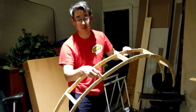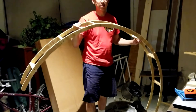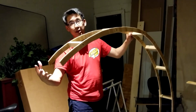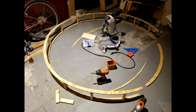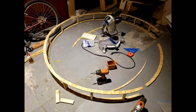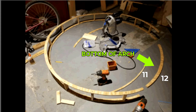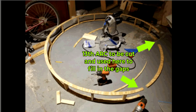We used some glue at wood joints. This section is about 45% of the arch and it'll fit in the back of an SUV. Don't simply repeat this section — look where the inner and outer pieces join and use the correct combination of short five-and-a-quarter and six-inch pieces to complete the rest. Out of 13 arcs, the first top part uses six pieces for three sections. Then four pieces make the two side sections in an over-under pattern, leaving two pieces for the bottom plus one extra for bridging.